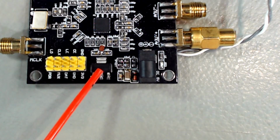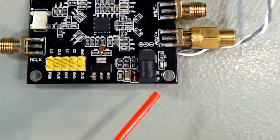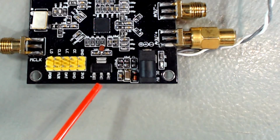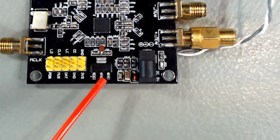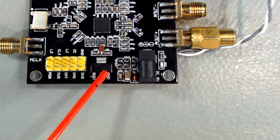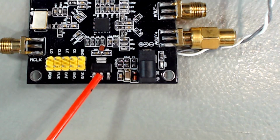By the way, the 3.3 volt regulator can take up to 15 volts. That's its maximum rating. So at 13, 14 it will be fine. It becomes quite hot. You can't leave your finger on it for too long. But in the world of electronics, a regulator that runs at around 50 Celsius or a little higher is okay. This part can run up to 150 Celsius. So at what we consider a hot level for the fingers, it's still okay.